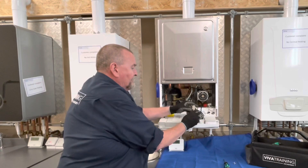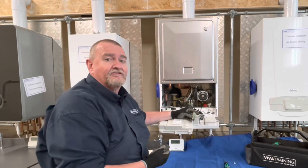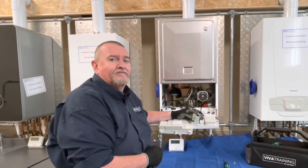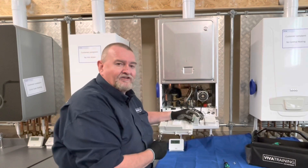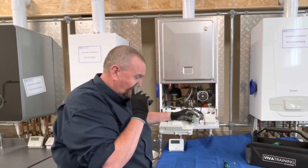So the next thing is to turn the tap off, power down the boiler, and safe isolation - TB118. We've done a lot of videos on TB118 so we're not going to go through it, but we're going to safely isolate it and then drain the boiler down just on the hot water side and remove that hall effect sensor and replace it.